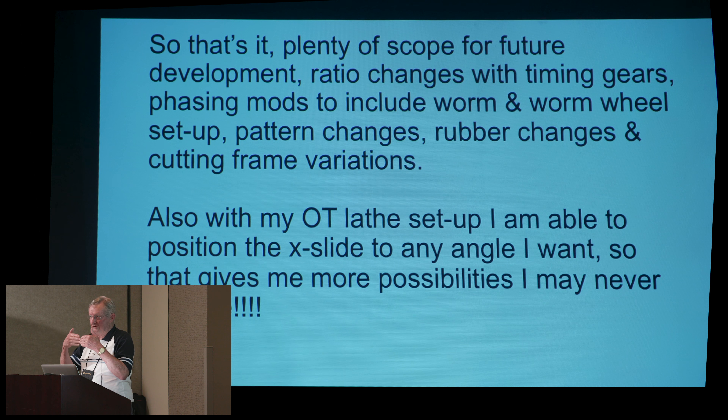In this case, I wanted the inversion — from top to bottom to be a straight line — so I put the flat on the template piece, and then that goes for the full length. So the lower shaft is actually the rosette you're using to cut the work piece — is that correct? Yes, that's right. That's the curvilinear, if you want to call it. Your touch and your cutter are travelling simultaneously. That's correct — they're on the trolley. The cutter and all that is all on the trolley, so that moves in unison. As the rubber is rubbing on the template block, the top one is cutting, and I can adjust that ratio any way I like.